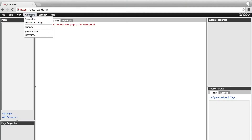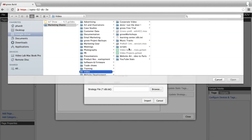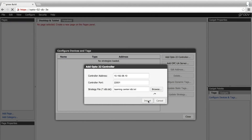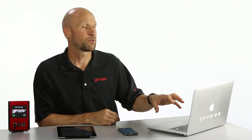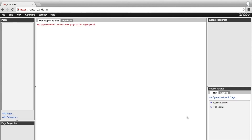First, for my OPTO 22 control system, I select add OPTO 22 controller, type in the address and then select the controller tag file. Now let's configure the OPC UA tag server. Choose add OPC UA server, put a name and then the address, colon and the port number. Click add server and we're all set. It's time to start building our interface. Since I'm building a mobile app, let's switch straight into the mobile view.